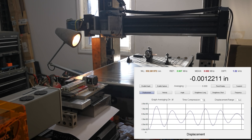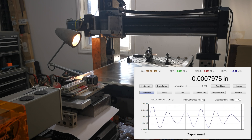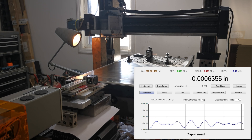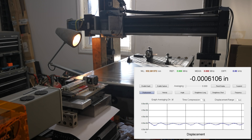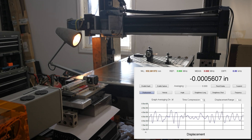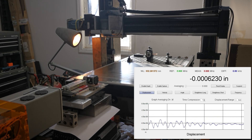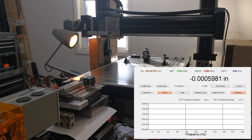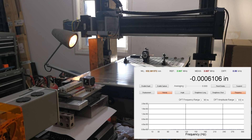Okay, we're back at zero. There seems to be a little bit of oscillation, but I think we'll find that we're back to within a couple of tenths. The reason we get this oscillation is that the interferometer is standing on the floor adjacent to the machine, so if the machine as a whole oscillates a little bit, or even if I jump on the floor, I can cause deflections like this. It takes a little bit for these oscillations to die down, but to some extent these are measurement artifacts. I do think that in the end we are back within a thousandth — or in other measurements I've gone to about two tenths. Another interesting thing to measure is the frequency distribution of the vibrations that this axis is experiencing.